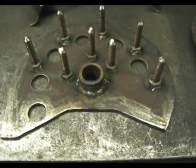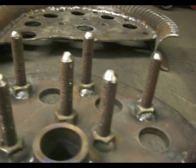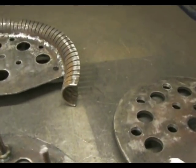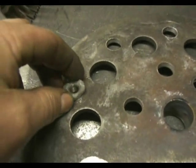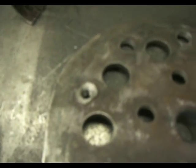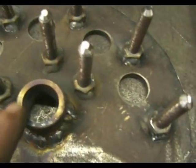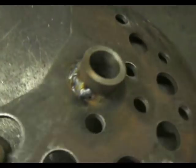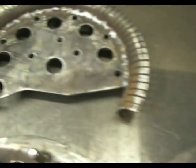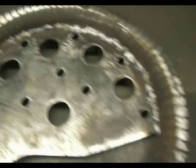When it's ready to assemble, I've cut all these bolts to the right height and put a wee chamfer on the edge of them, because they will fit into these holes that I've made these wee spacers up with. They slot in there and then they'll be welded — you'll see that when it's assembled. I've welded the rotation pin sleeves on the top and bottom plate, fully welded them, and they all get tacked as far as I can reach in there once it's assembled both sides.